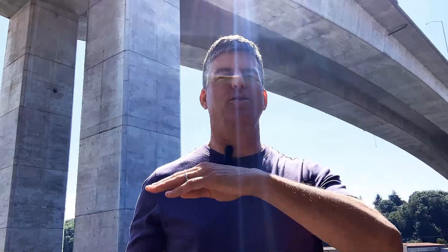So let's talk about the construction of this particular bridge — I'll leave the structures analysis to a structures class. The main span, which you can see behind me, is actually a post-tensioned segmental box girder bridge. It's segmental construction: they build the bridge pier up and then build the bridge out from the pier in alternating segments on either side. It's called a balanced cantilever approach because the bridge cantilevers out from the pier and they balance the load by building one side and then the other alternately.